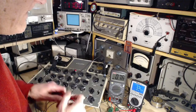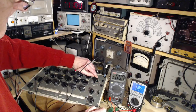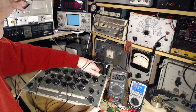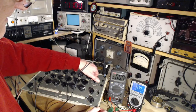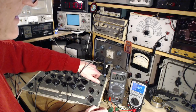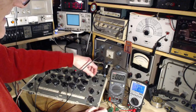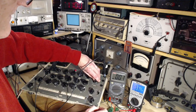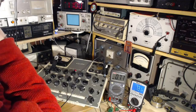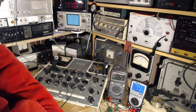What happened here? When I had this off, this went off - I never noticed. So putting it here breaks the heater. Is that true of the short test? The short test breaks the current - that's interesting. And then when you come back to the test spot, the current is restored to the tube filament. Another little lesson learned. But we're still not getting anywhere with this.